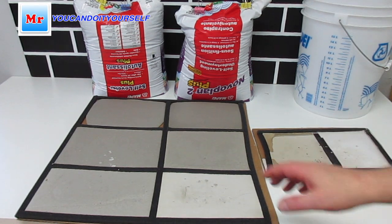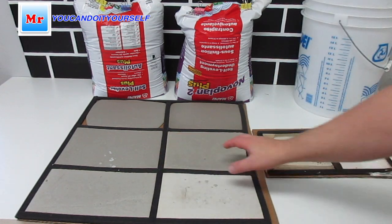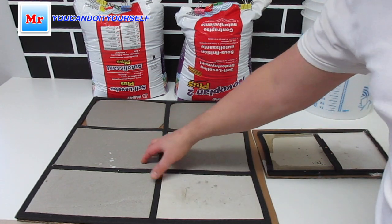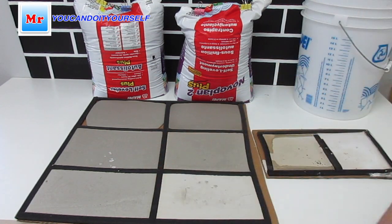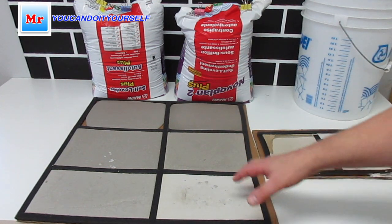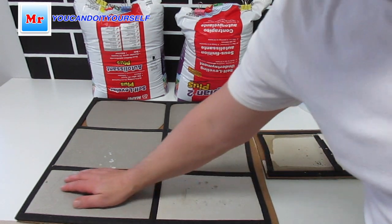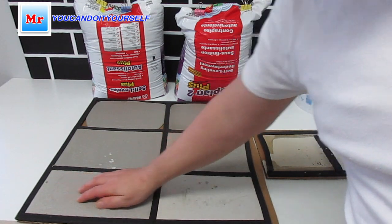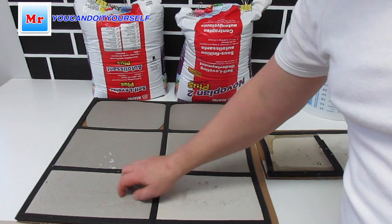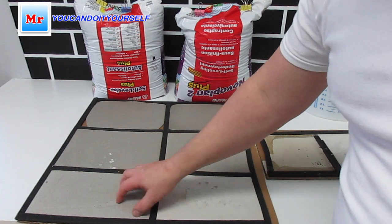and what I want to tell you, this material dries very fast. This is dry, Novoplan 2 dries a little slower. For example, if this settles and gets harder in half an hour, this is maybe an hour or more. So if you add a little bit more water, it's not a problem. It's really smooth and nice, the surface, and solid, you can scratch. It's not separated, so all components stay together.